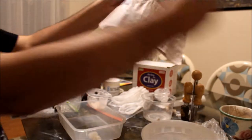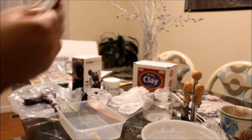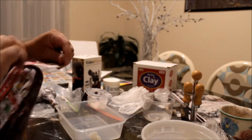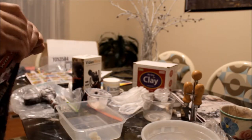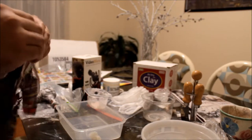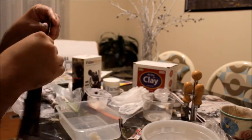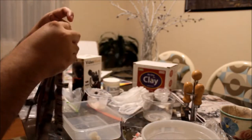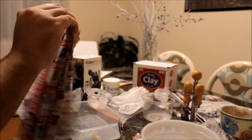So now we're going to move on to creating the mold. The first thing we need to do is take that old newspaper or magazine and rip it up into strips. Ideally you should be using some other type of fiber for this, like hay, but newspaper will do in a pinch. The purpose of the newspaper is to keep cracks in our plaster to a minimum. You should have at least enough strips ripped up to be able to wrap your clay shape in twice over.